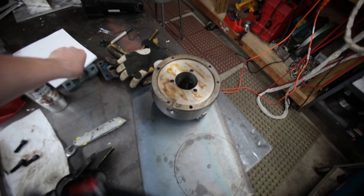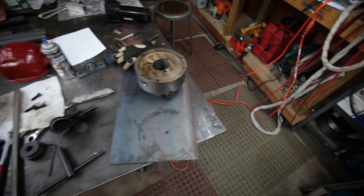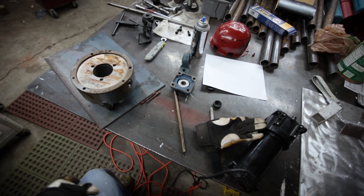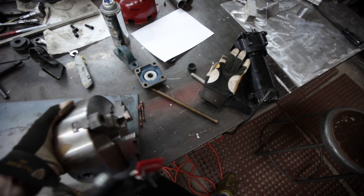I've got a shaft, some pillow block bearings, and I now need to make a flange. A weld positioner is a machine with a three-jaw chuck that slowly spins round parts so you can weld them. A lot of them have a through shaft for back purging stainless steel sanitary tubing with argon, but I'm not doing that on this one — I just had some bearings left over from another project. I'm building this with a three-quarter keyed shaft because that's what I had. I'm trying to keep this build under about $300, though it'll probably be a little more since I had the bearings and stuff left over.